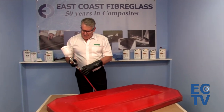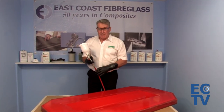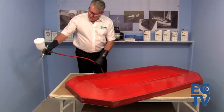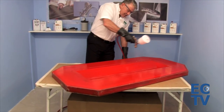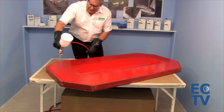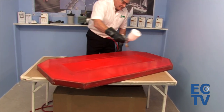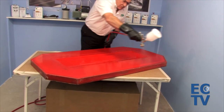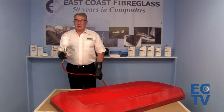It's always important to follow the contours of the mold — remember, a spray only goes where you point it. Always maintain the same distance, try to follow the contour of the mold, keep the speed constant and the distance constant, and you will have a lot of success with Spray Coat FD.